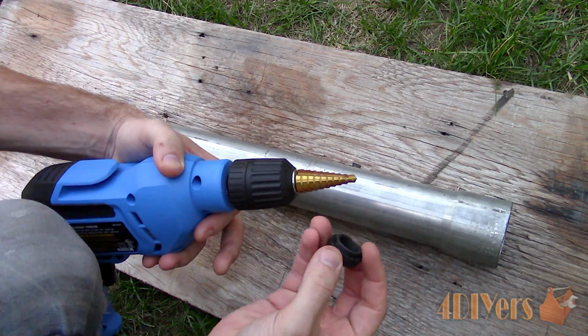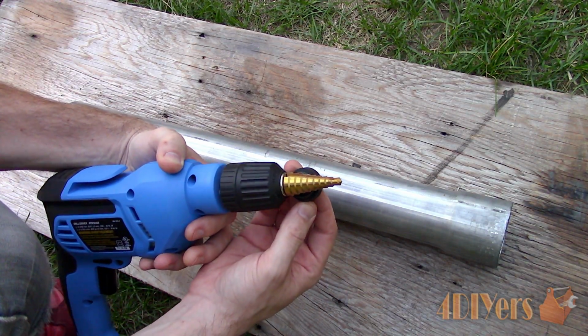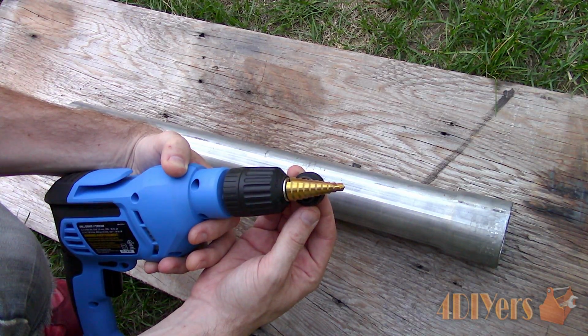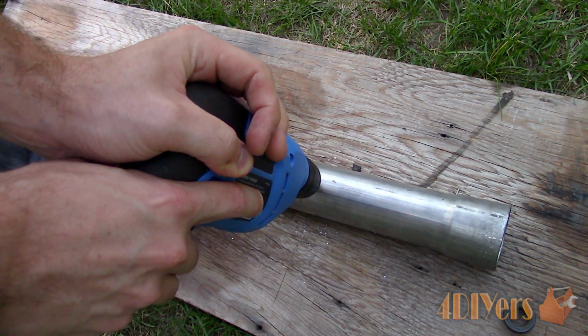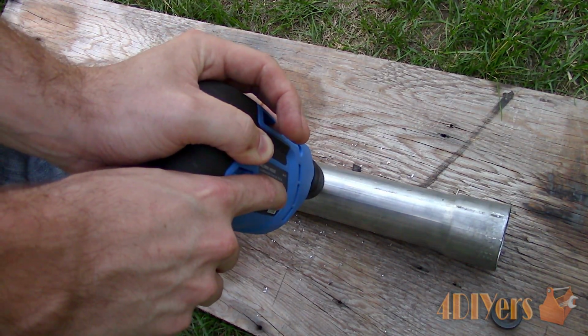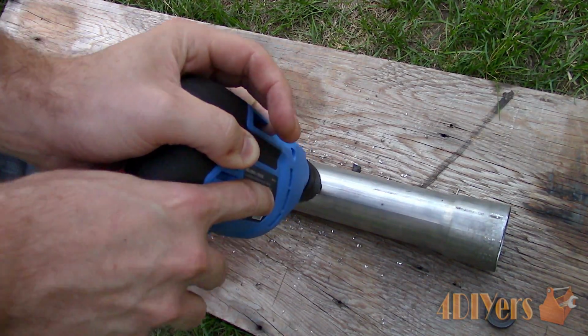It should be mentioned that the sensor should be installed anywhere from a horizontal position to the top of the pipe, meaning between the 9 and 3 o'clock positions. This ensures the sensor will not be affected by moisture sitting at the bottom of the exhaust pipe, which may jeopardize its life expectancy. You'll see this a little better once it's installed back on the truck.